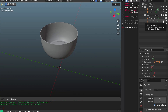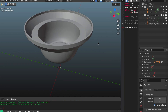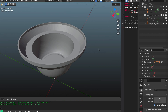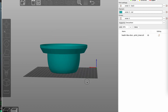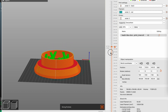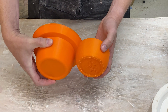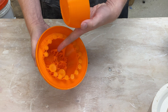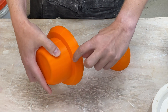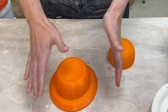I like the size and shape, so I'm going to go ahead and use it — I think it's a good complement to the tumbler. Back in the software, we scale it up, and then we add the slip well, which happens automatically. There's the shape saved as an STL. Here it is in the slicer — flip it around, slice it up, and print it out. Here is the two-scale final version and the scaled-up version we need to make a mold of. It's got the supports on the inside. My print got a little bit messed up with the supports, but it worked okay. The form is obviously larger, with the slip well added, just like before.